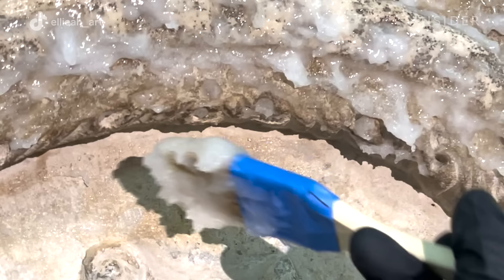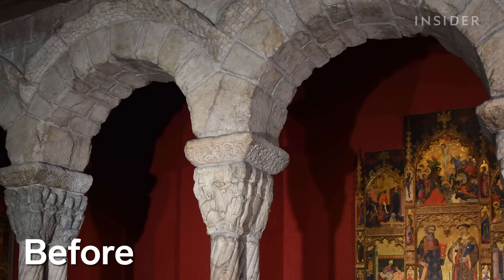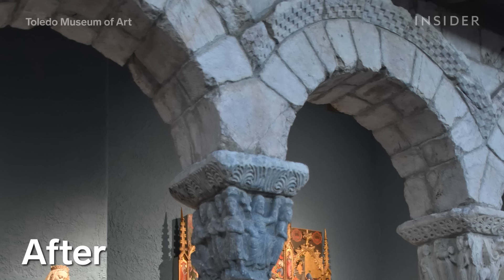Once all of the surfaces are checked with ultraviolet light and all of that gel film is removed, the final step is to use wet cloths to wipe down all surfaces. This will also rehydrate any remaining gel on the surface so that it becomes noticeable to the naked eye, so that anything we missed with the UV lights can then be removed.